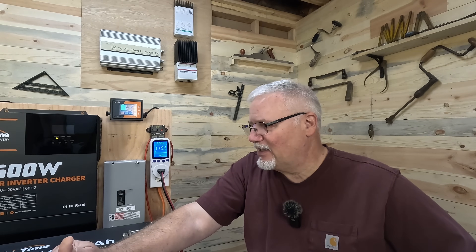Can it work without a ground? Yeah, it can, but I do think that's not good. From a safety perspective, you should ground the system. When I hooked this up, because I hooked it up to a GFCI circuit, I couldn't hook up the ground on the utility side or it would just trip the GFCI. It's not designed to be set up that way. You'd have to put in some grounds, and that's entirely doable. But because this system's not going to sit here, I don't want to put a hole in the wall and run a ground outside. I don't have a ground in here that I could use — otherwise I would have grounded it.